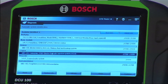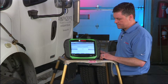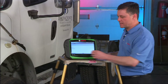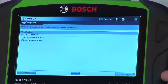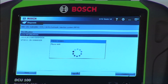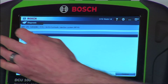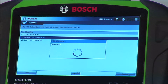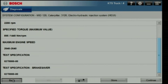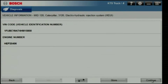I'm going to select the engine and go take a look at some of the Caterpillar controls that are available. I haven't talked much about the identification button on the top of our list. That'll actually pull module information from this controller — it's pretty valuable stuff. You can get an ECU serial number out of it. You can also determine which software the controller is running. There's some configuration information available, torque and RPM ratings, and some vehicle information including VIN number. This is the VIN we were able to pull and decode for this vehicle.